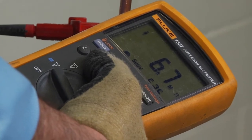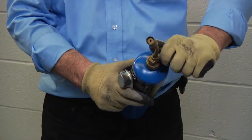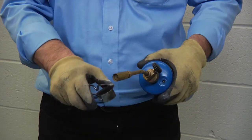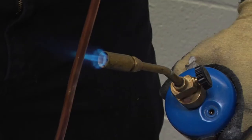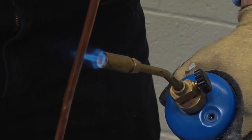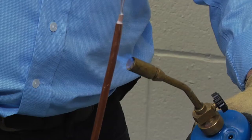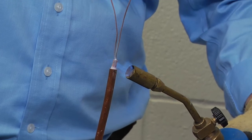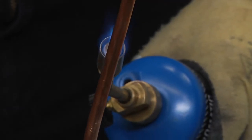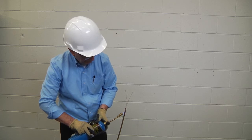If your cable's IR readings are low, it means that moisture is present at the end of the cable and it must be dried out. To do this, use a propane or MAP gas torch with a large flame and heat the cable beginning 12 inches (30 centimeters) from the end. Use a short sweeping motion of the torch and gradually move the flame towards and past the end of the cable.